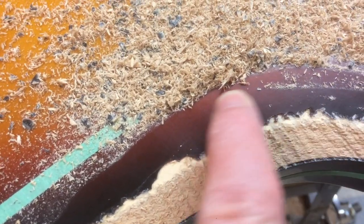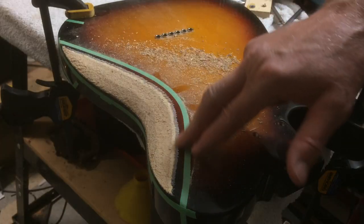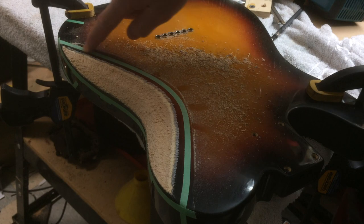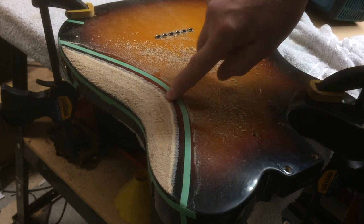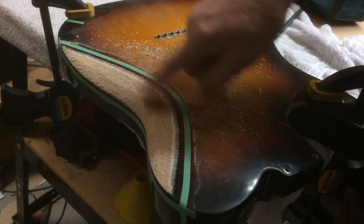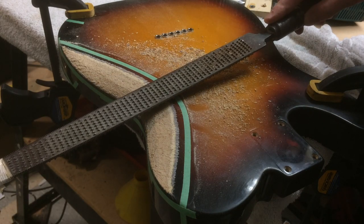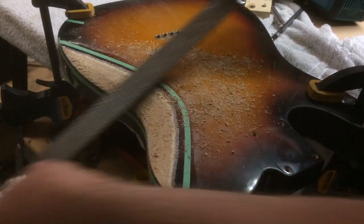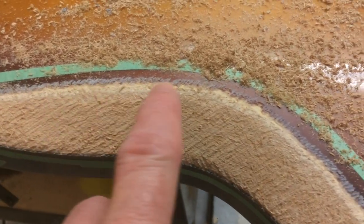I'm getting a lot of chipping from this poly — look how thick that finish is. But I'm still not going right up to the tape edge. I want to leave a little space and bring that down with the barrel sander and hand sanding. There's a little peak here because the angle of my rasp was slightly upward on both sides, but I can clean that up without hitting either side. There are also deep grooves left from the file, so a lot of material still needs to come off.